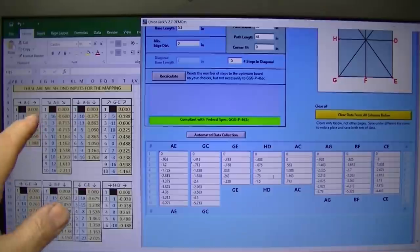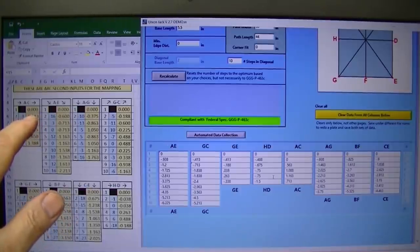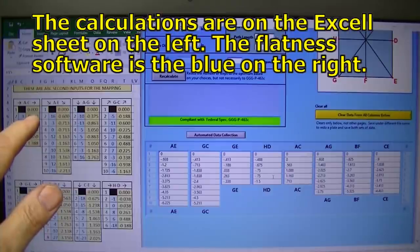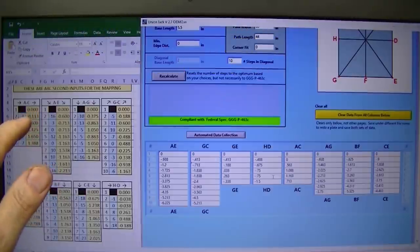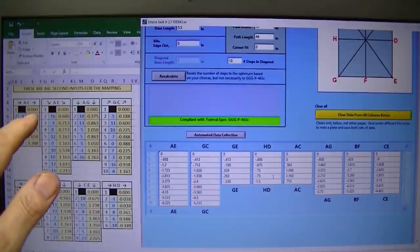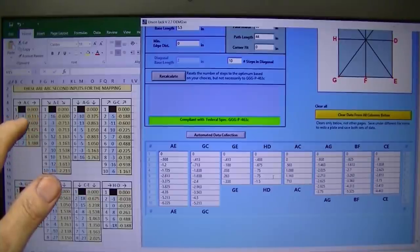So I have a formula in here that converts the rise of the repeatometer foot into an angle relative to the other 2 feet in arc seconds. And then it has to add it on top of that because the autocollimator reference never moves, whereas on the repeatometer, its new reference is where it just was.